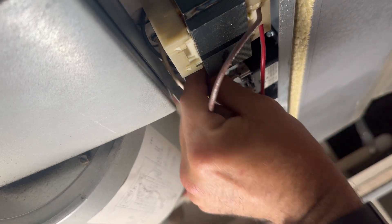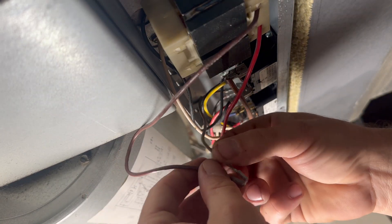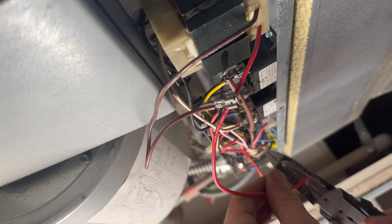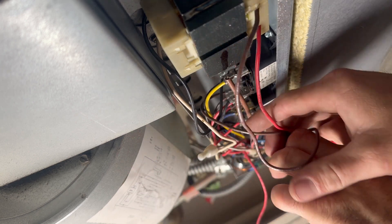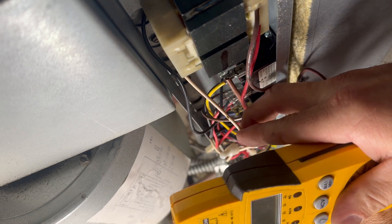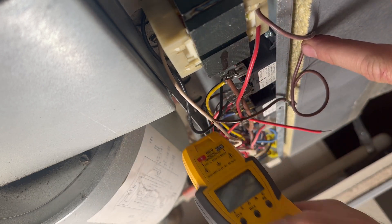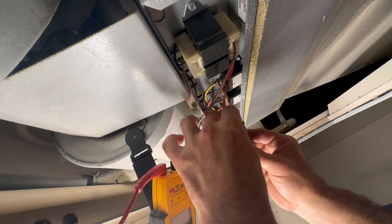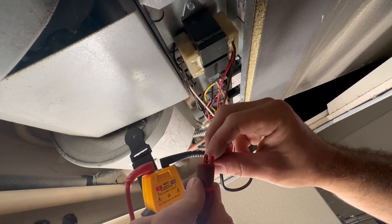This is your common. I'm going to remove that, and here's our red wire — I'm just going to cut this, I'll show you why in a minute. Okay, get our low voltage wires out of the way. Here's our neutral and hot wire coming in — this is 120 volts. I just want to verify power's off, so I'm going to hook my meter leads with alligator clips up to the power coming out of the transformer.